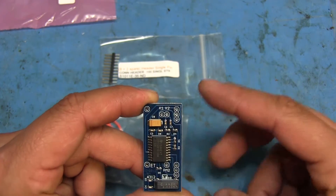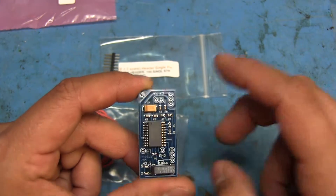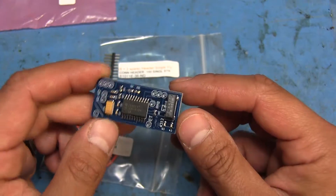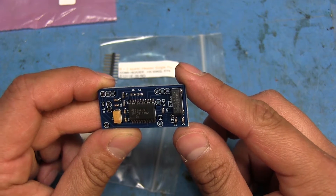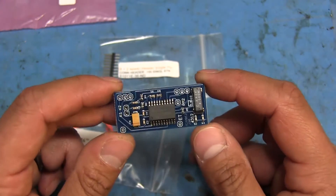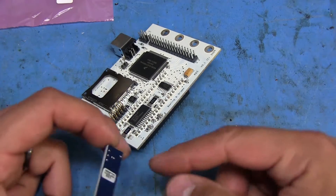As you can see right there, K1 and K2 for the two knock sensors. There's also a pin labeled PM2 that goes to one of the pins on the CPU board. This little board has an 8 megahertz crystal and a chip labeled TPIC8101DW - I haven't looked that up yet.